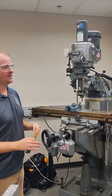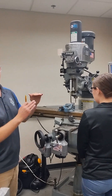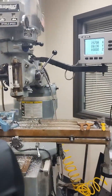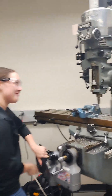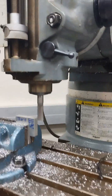Now what we need to do is set up our depth for the cut on the Z axis, and then we need to touch off our X axis so we know how to make that cut. Let's go ahead and set our depth. We want to go to a depth of 0.75 — 750 thousandths. You can see the bit is now moving down.